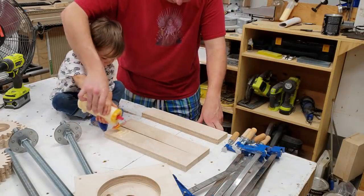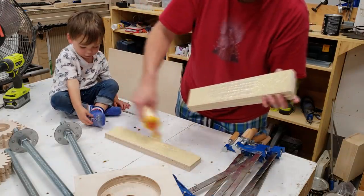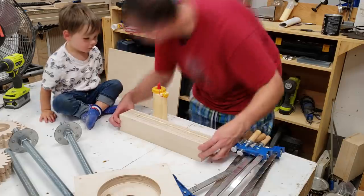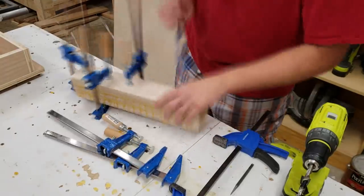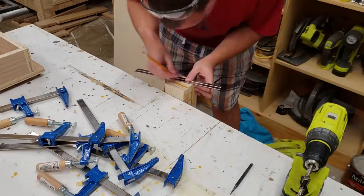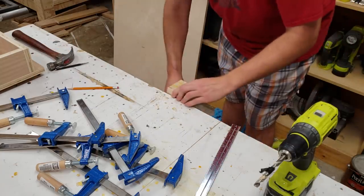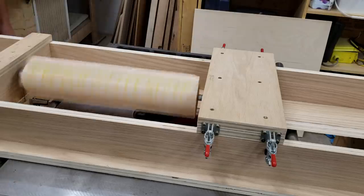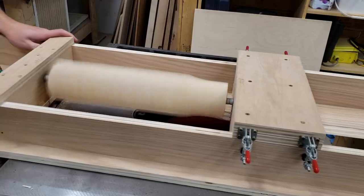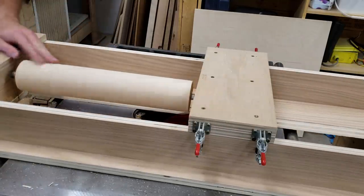My super special helper applies some glue to 1 inch Baltic birch plywood as I want to glue it into a large rectangle, then bring it over to my table saw lathe and turn it down for use as the knuckle which holds the handle of the vise on either side. Once dried overnight, I remove the clamps, mark the center, clamp it to the side of my table, and drill out the two different size holes — one for the screw that turns it on the table saw lathe and one for the blank hole on the tail stock. I turn it on my homemade table saw lathe, which is awesome for making cylindrical objects fast. If you're interested, you can visit diybuilds.ca and download a free set of plans and a CAD model.